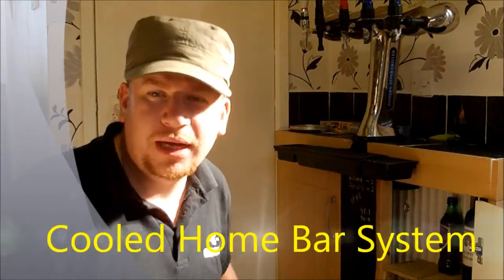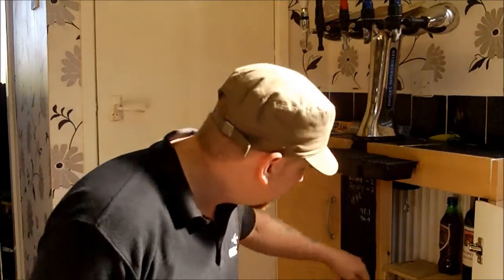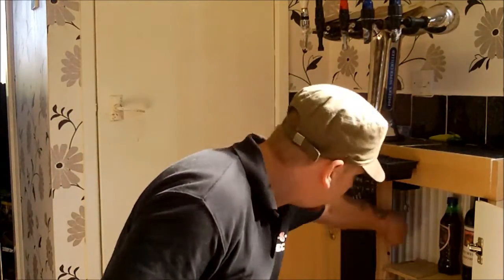Good morning. Today we're going to be looking at changing some of the pipework on our beer font. We're drawing a couple of what you'd call overly carbonated beverages such as ciders and lagers and we're having problems with foaming at the tap. To resolve that, we're going to be taking some pipework out and replacing the pipe in there, which is 3/16th ID, with this quarter inch ID pipe. This should enable us to have a much heavier flow without quite as much pressure at the other end. We'll take you through it step by step so you can see exactly what's behind the bar and font and how it works.